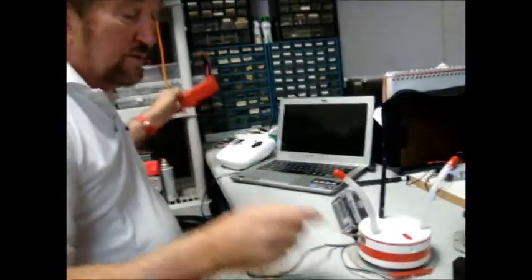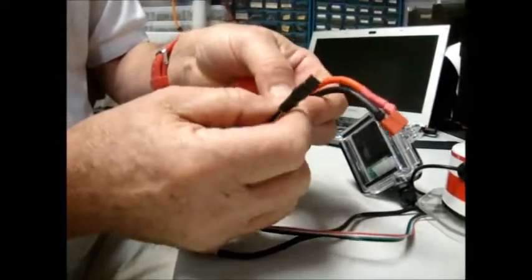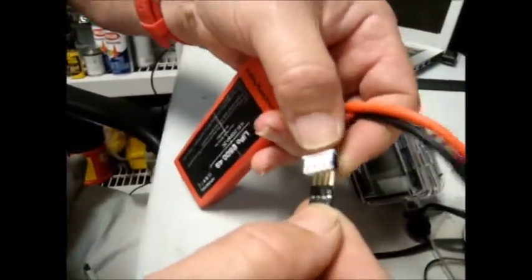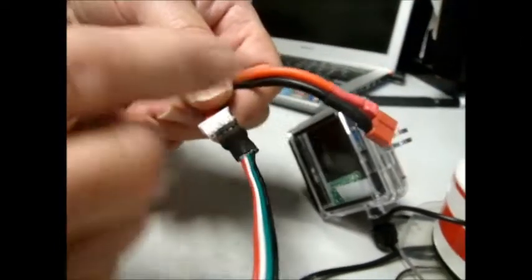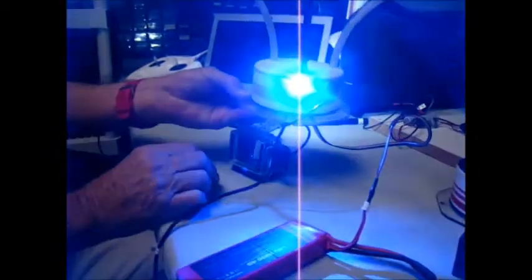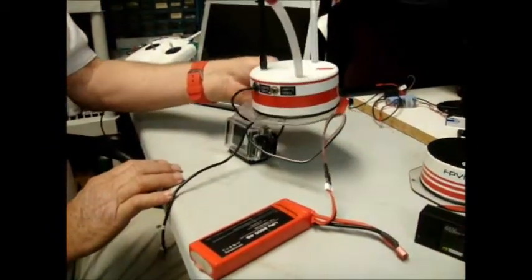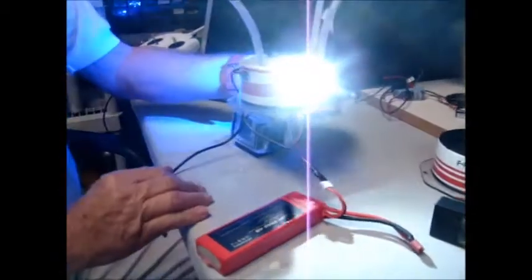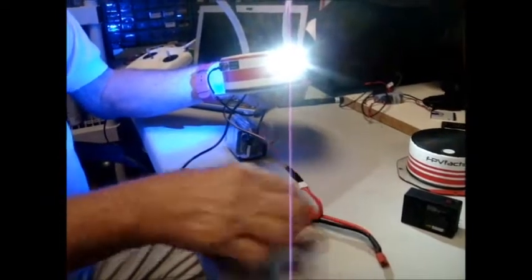To give a demo: this is the power cable that comes down and fits inside the battery charge plug — make sure black to black. I've got green, white, and red, providing either 3.7, 7.2, or about 12 volts — I only use the 12 volts. If I turn it to the light direction, there is my white light and there is my blue light — three watts of high-intensity power, visible even in direct sunlight. Now flipping it to the video direction, I am transmitting video as well as having both lights on, all pulling power from this single connector to an existing battery.